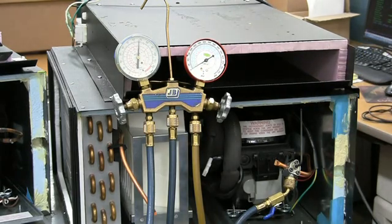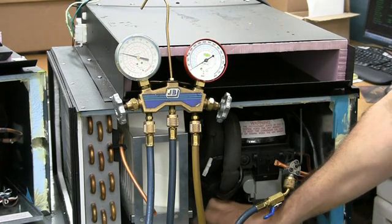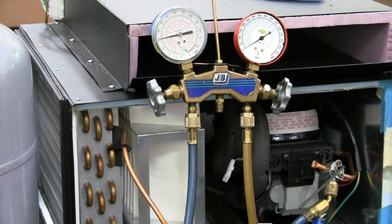Since there is gas in this system, we'll turn on the compressor and see if it's pumping. If the compressor is working properly, it will pull the pressure down to 20 to 40 psi, depending on the temperature of the system. If the pressure doesn't come down and even rises slowly, the compressor has a mechanical fault and needs to be replaced. If the pressure keeps going down and goes below 10 psi, then the system is either low on charge or has a restriction, as shown in this case.